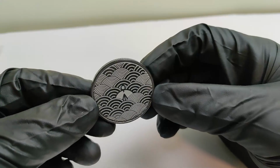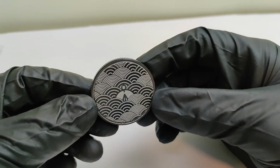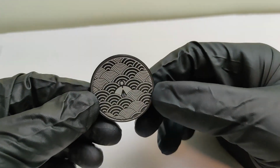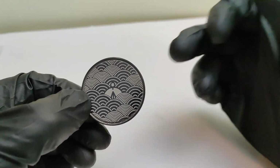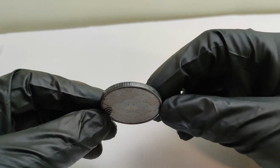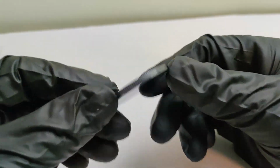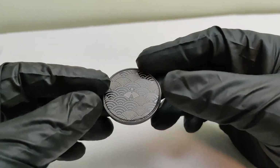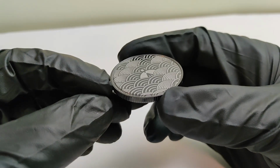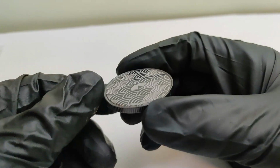Okay, here's the end effect, the finished product of my coin. It's pretty angle proof. It looks just as good from all angles, because I wasn't lasering the black mark, I was lasering the gray mark. The black is still nice and shiny just because it started shiny. If you overflow your design into the V-groove, you can see how it cascades over the edge and gives a nice 3D effect.